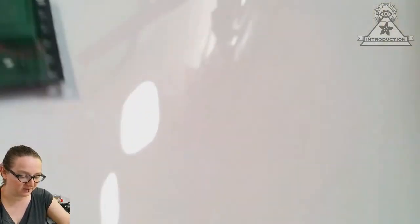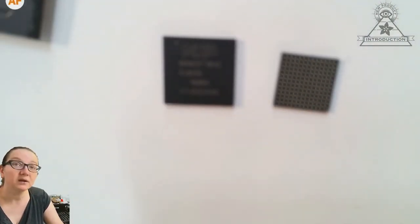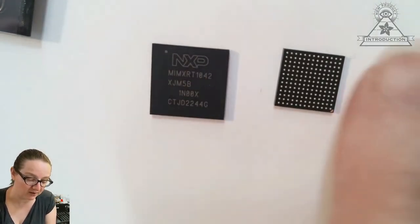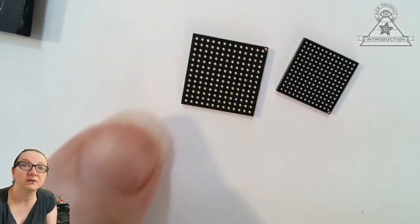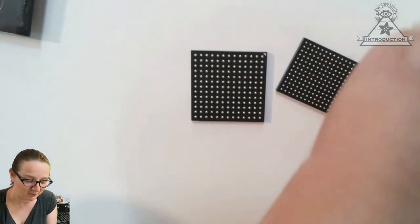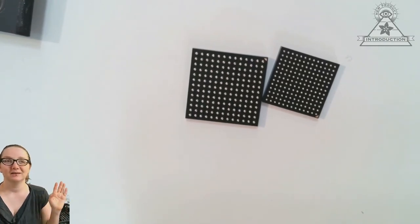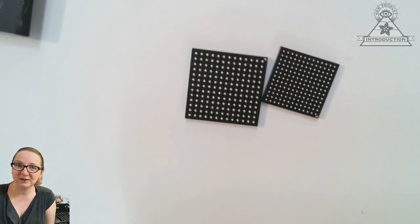Now let me show the chips themselves — I have to go really small because these are very small chips. This is the same chip, but one is 0.65mm ball pitch and this one is 0.8mm. I'll flip them over so you can see the comparison. Which do you choose? Well, 0.8mm is easier to route but bigger; 0.65mm is nice and compact but you'll need a high-quality PCB manufacturing process. Both have the same silicon inside — just a different package on the outside. So that's the IMX-RT-1040 series.